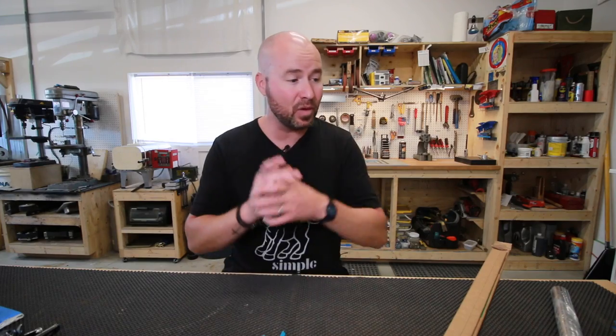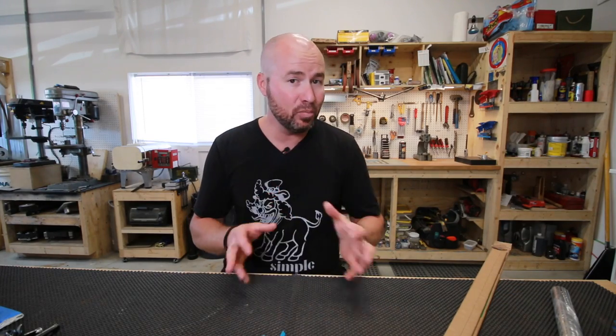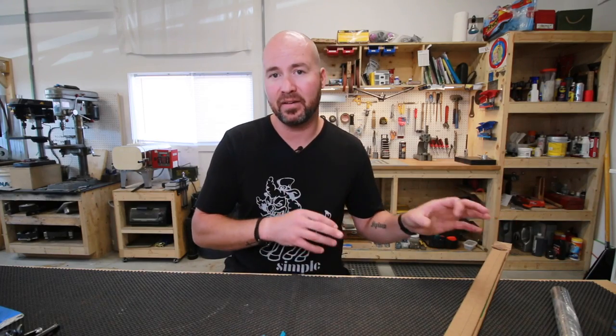Now, there are some stainless steels that you don't need to do a cryogenic treatment on. Nitro-V is one of them. It's touted as something that definitely benefits from cryo, but it's not necessary. I have done a few blades in Nitro-V without cryogenic treatment, and they turned out phenomenally well. They held an edge really well, and you can get that on some of these stainless steels even without cryogenic treatment. Now, I've also been doing a lot of reading and research that high carbon steels like O1 can really benefit from a cryogenic treatment, and I do believe that every single steel would benefit from cryo.